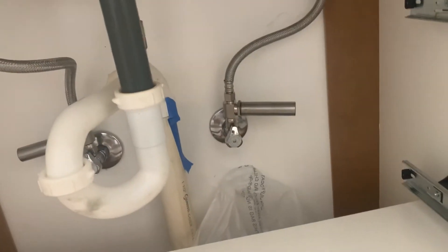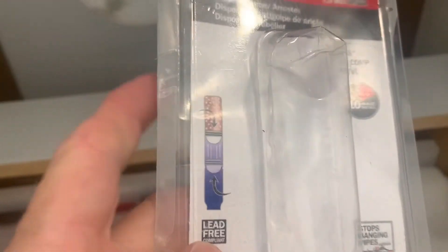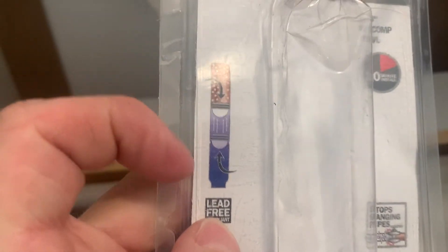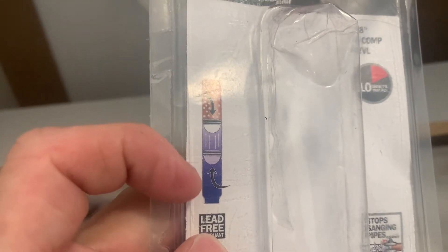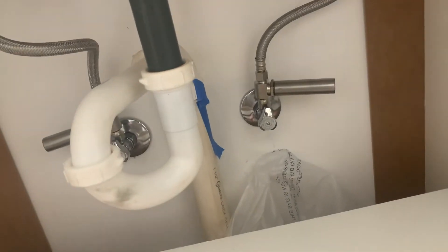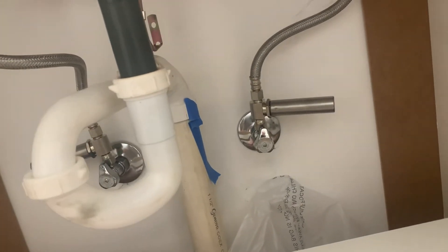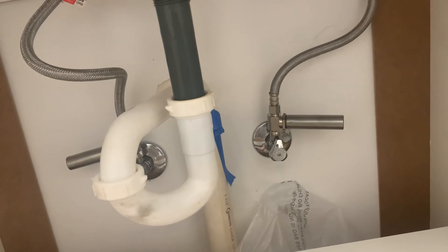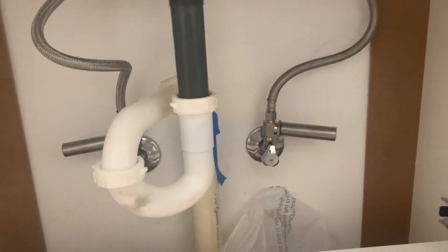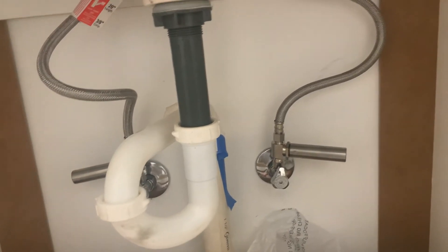You can see roughly here how they work — they've got a little diaphragm and some air pressure inside, so when you get water hammer back up it just compresses the air and then pushes it back down. This may not have been the problem, but it may have contributed to it. So for $20, I can make sure I don't have that issue again. Talk to you soon.